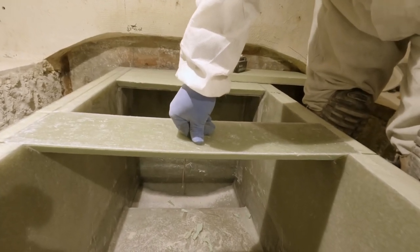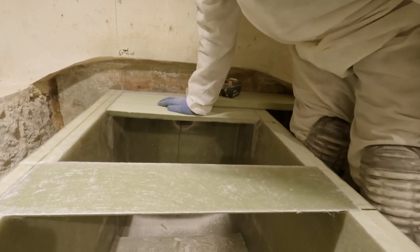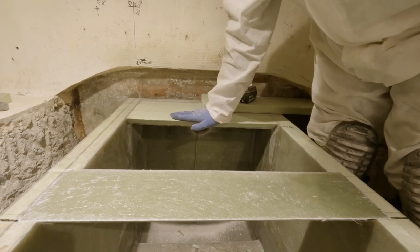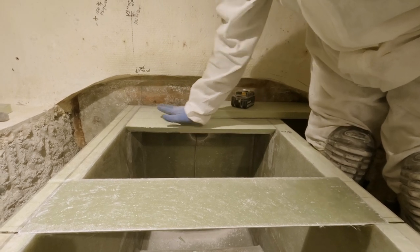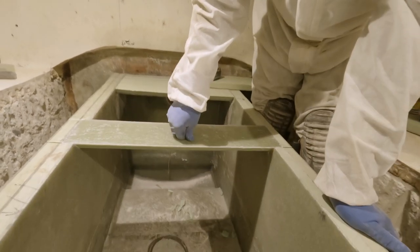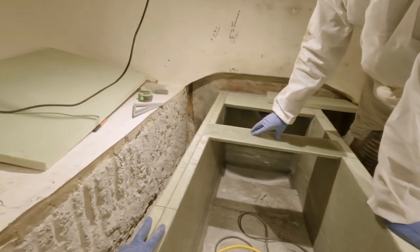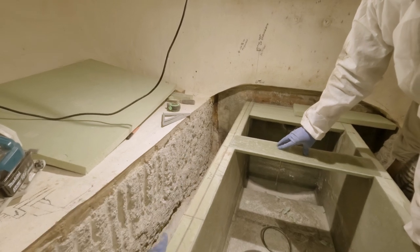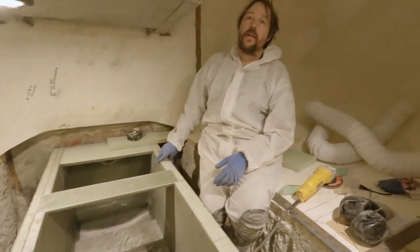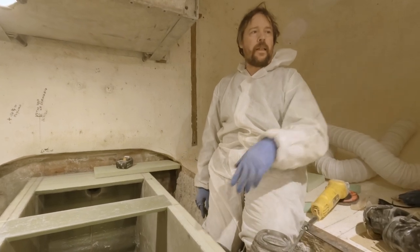You can see how much structure this is going to add. If we push on that, it flexes. But this one up here has already been tabbed underneath - if I push on that, there's very little flex already. So now envision putting another layer on that glued to this and then another layer on that - you're not going to have any flex at all. It adds a lot of structure very quickly. Like with these stringers, a single layer had a lot of flex, but when we were done with them - when they were both laminated together - they were just solid. Very, very solid. So we get this next one, same thing, laid out, we'll cut and continue on down the line.